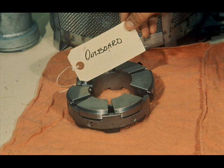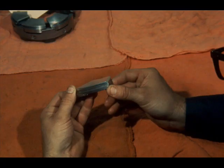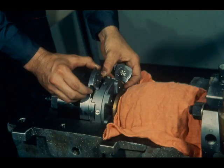It's good practice to keep the bearing components separated and identified as to position. As you can see, these parts are labeled outboard. Even though the shoes in this particular thrust bearing are identical, and when new they could be placed in any position in the bearing assembly, after they have been in service a wear pattern will sometimes develop. In that situation, the shoes on one side of the collar may have slightly more wear, and it would not be practical to mix shoes from both sides of the thrust collar. Some thrust bearings utilize shoes designed for rotation in only one direction. With a bearing of this type, it is important that the bearing components be identified as to location during disassembly. Using the same procedure, remove the thrust shoes and the base ring from the inboard side of the thrust collar, and place them in the protected area.